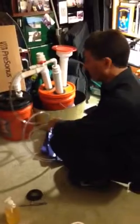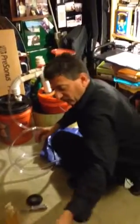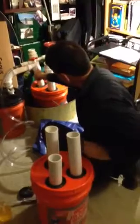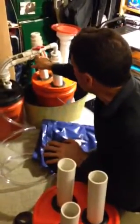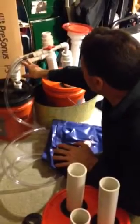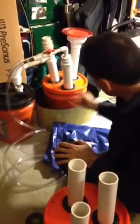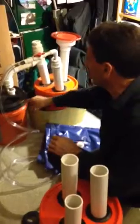We use standard clear PVC hose for the gas out valve. On the slurry pipe — the shorter one — I've put a sanitary tee, which is the cheaper tee, and then it comes out through an elbow and down into the slurry or fertilizer collection bucket, because every time you feed it a cup of food waste, you're going to get a cup of fertilizer out. Then I have a reducer here to half-inch with a hole.